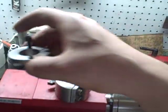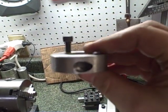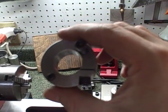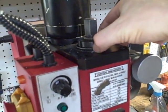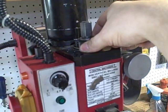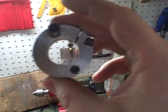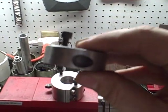I made this one — the ring — about three or four days ago. Basically I cut this out with a hole saw. I was making a belt drive plate and needed to cut this bit out, but I have no way to chuck that up in my lathe — there's not enough swing — and I didn't want to pay to have it machined. I can't really bore it because I'd chew up my plastic gear, so the hole saw was the only option. I ended up with a couple of discs since I had to cut two holes — one for the motor mount side and one for the spindle mount side. This one is the spindle mount side and it's a little thicker.